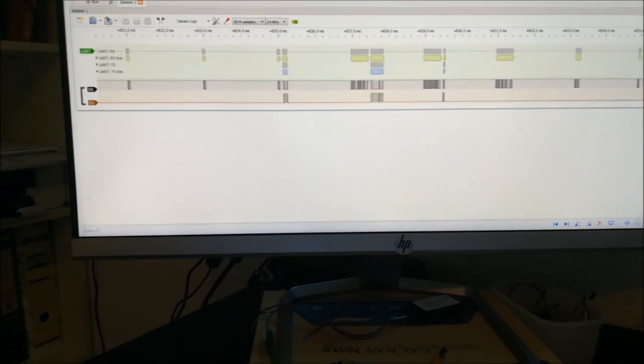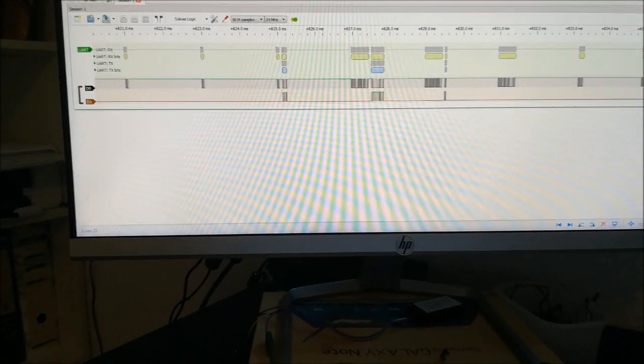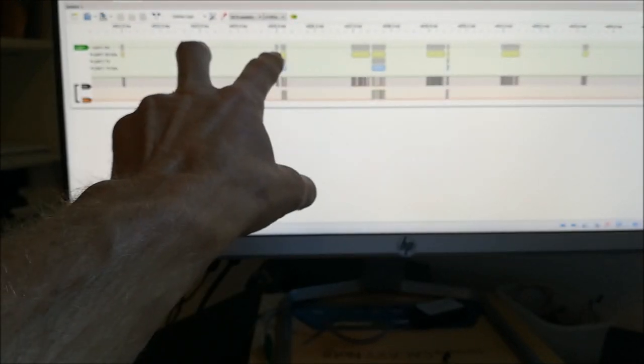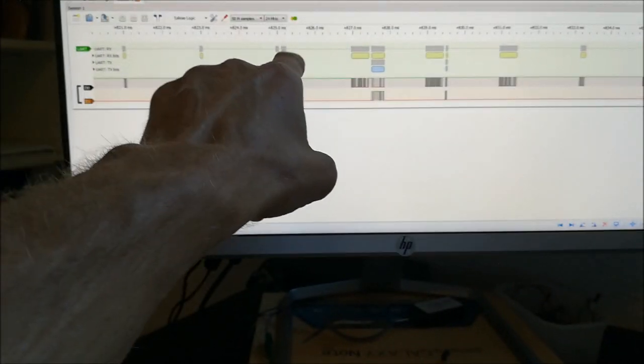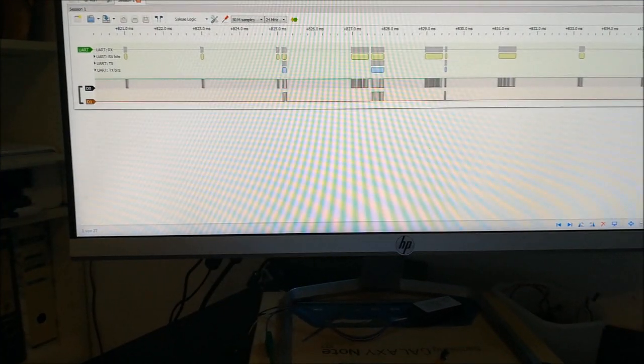And how this is solved is that the transmitter, I think every 20 milliseconds, or 20 microseconds, sorry, I'm wrong, every 2 milliseconds, sends a data packet from the transmitter to the module. If the module wants to send something back, it can send it within these slots it has available. Here you can see the packets sent by the transmitter to the module, and here the packets returned from the module to the transmitter with the proper timing.